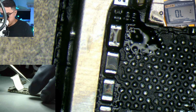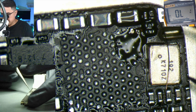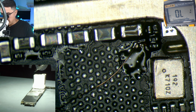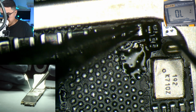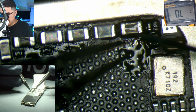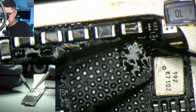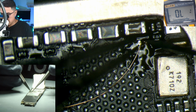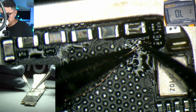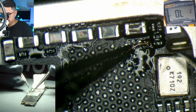By the way, on that iCommands Stylo software, there's also a way to test the audio IC. So anytime you have an issue, oh, by the way, I forgot to mention, purple mode is only supported by devices A11 and older. So like iPhone 10, iPhone 8, iPhone 8 Plus are the newest models it supports. Anything else does not support it, therefore you cannot use the iCommands Stylo software for solving. You have to use the old-fashioned way using standard diagnostic methods.